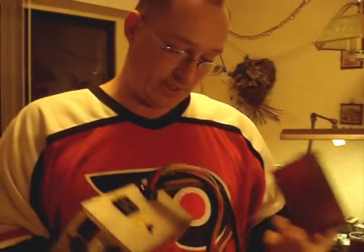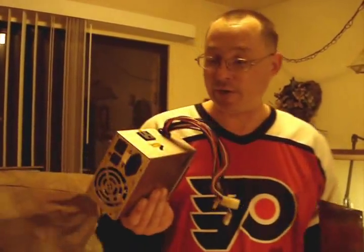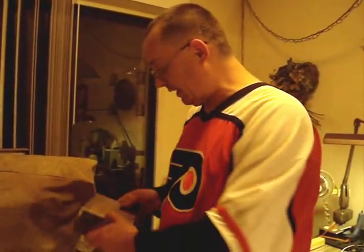We have these connectors here. It tells you what they are: plus 5 volts, 20 amp maximum load, a ground, minus 5 volts with a half an amp, 12 volts with 8 amps, and minus 12 volts with a half an amp. It's going to be pretty flexible — it's bipolar, which means there's two of them in there. Sometimes you need bipolar power supplies if you're working with something that's a bit unusual. The nice thing is it's got an adjuster for the 5 volts, so you can drop it down to about 4.5 and up to almost 6.